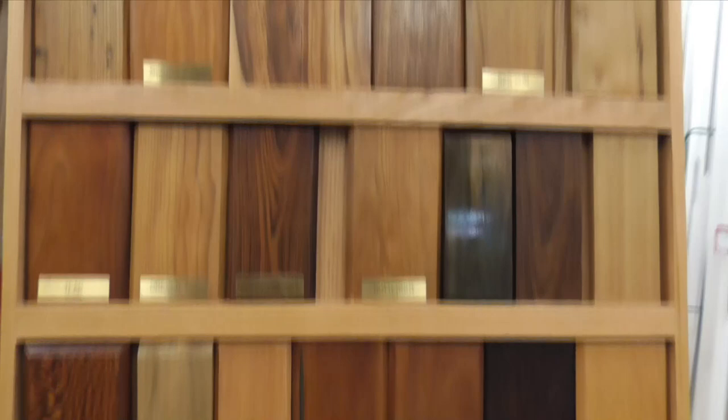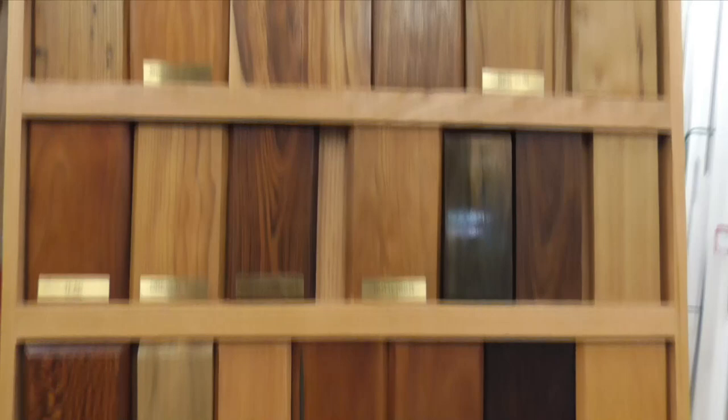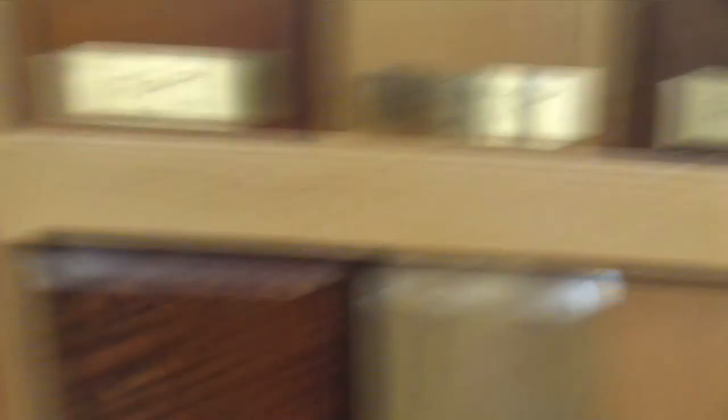Therein you'll find all sorts of woods with all different properties. But we are trying to look for woods that are not going to pull the eye away from the artwork. So we're going to want woods that are darker, but dark woods are also quite expensive, so you're a bit limited budget-wise on what woods you can get. But things like wenge, dark walnut, Indian rosewood, and African blackwood are reasonably affordable woods in order to make these pieces from.